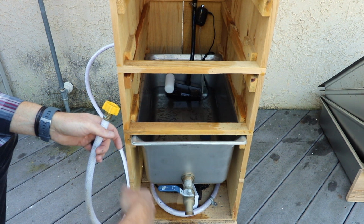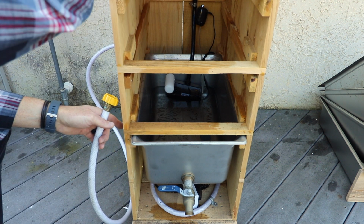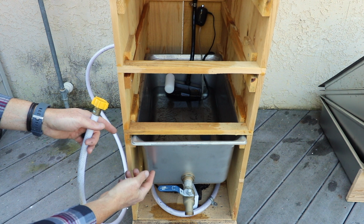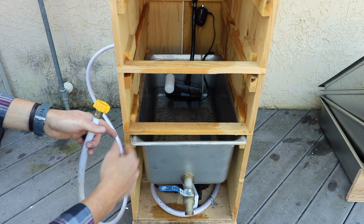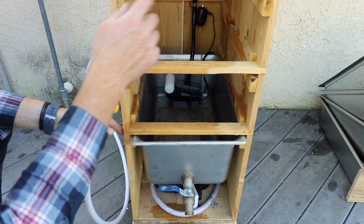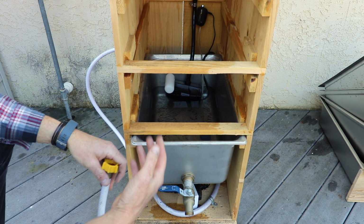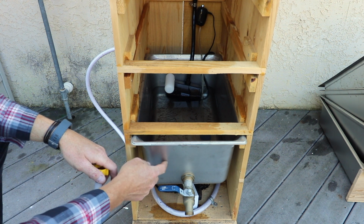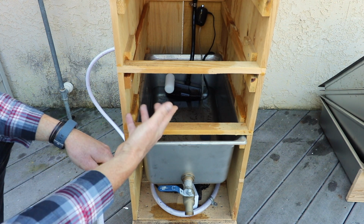how often this circulates, meaning how often is the pump going to go from here and pump the water up to the top. Its default setting is to do that twice a day at 11:50 a.m. and 11:50 p.m., where it takes the water and circulates it from here to here. As the water zigzags down, that's where it's picking up all the mineral-rich leachate along the way, and it drains into this tank where, again, it's aerated, so it's not sitting there going stagnant or anaerobic.